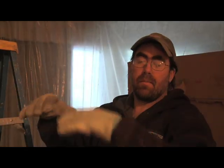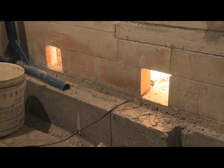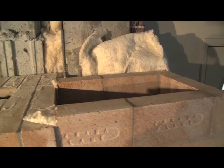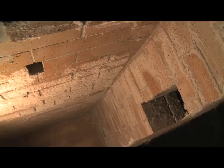As you recall, we put a chimney liner in and we poured concrete on a cold day. So we insulated, after we finished the pour, we opened the chimney top, the chimney damper, we put insulation on the top. And that light bulb provides enough heat that convection will take warm air up to the top and keep the chimney insulated for a few days while the Portland cement cures. And it also helps to cure the refractory mortar and the bricks. So the moisture of that mortar needs to be driven off before we have a significant firing in use of the masonry fireplace. If we keep that heated by the time we get the face put on and ready to fire, it should be fairly well cured.